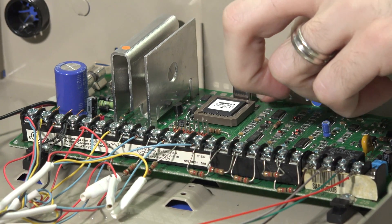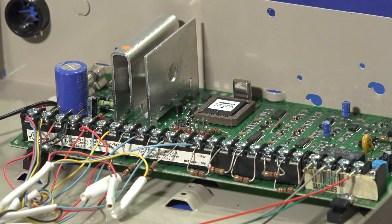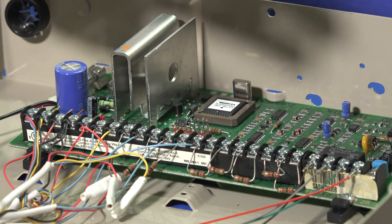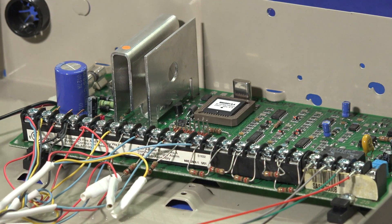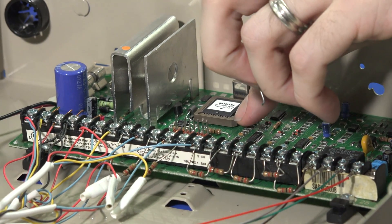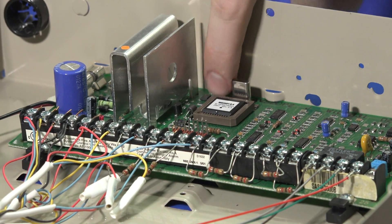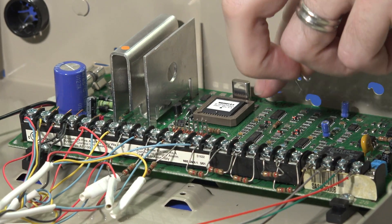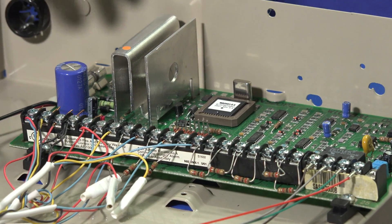Conveniently, there are two notches on opposite corners of the PROM so that you can insert your two silver levers into the holes, push them close towards the middle of the PROM, and then you have something to pull straight up away from the board. This prevents you from having to put any pressure on the PROM holster, which can potentially crack that holster if you were to try to pry it out of the holder.